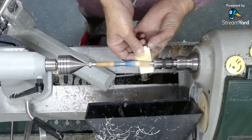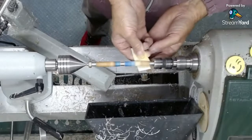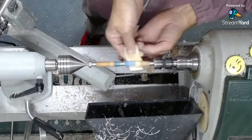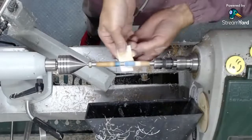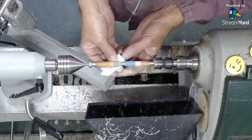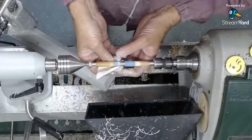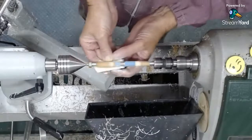Woodwork learners asking, looking for an alternative finish than CA on wooden pens. Suggestions: wipe on poly, melamine, friction polish, or Hampshire Sheen high gloss, and just let the pen build a patina over time.